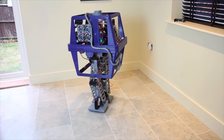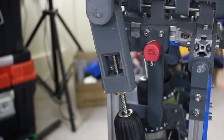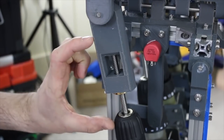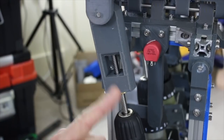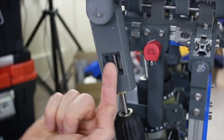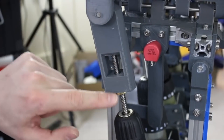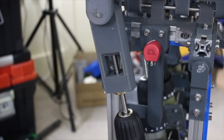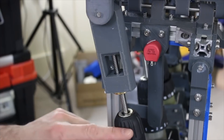Effectively this is the next generation, and hopefully just another nut facing the other way — we looked at testing that with some spare nuts last time. Obviously it'd be ideal to have the nuts as far apart as possible to prevent that lead screw moving too much around that axis, but when the lead screw's right out it's right at the end, so putting the nuts close together is the way it's going to have to be. I could put three nuts in total and that would help when the lead screw's extended.